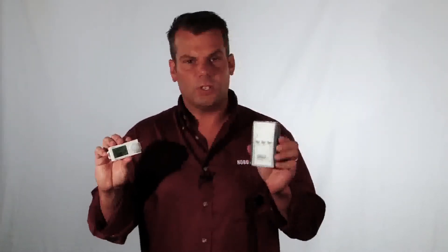Both models are available in two memory sizes. The standard memory is 84,000 measurements and the extended memory is 346,000 measurements. There is a USB port on here. You're able to download your logger to HoboWare for Windows or Macintosh. You can also download to our Hobo Data Shuttle which is part number U-DT-1. This allows you to easily download and restart in the field.